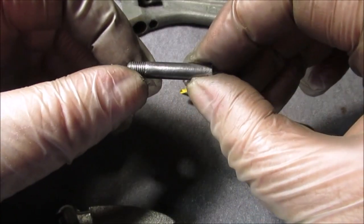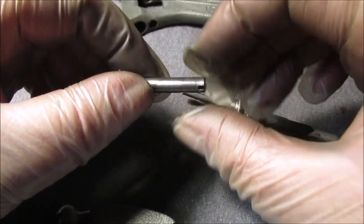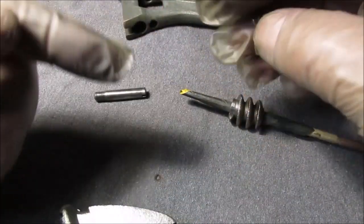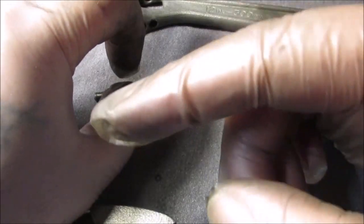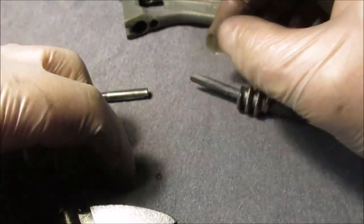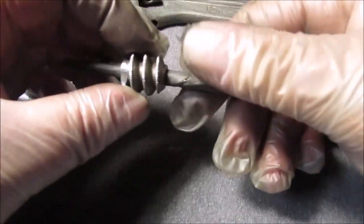We held this with rubber vice grips without damaging the threads. We have a two-inch wire brush in the drill. Here's the wire brush spinning right here — we're over here on the side, so the round part of the brush bristles are working here. We're out at the side so bristles don't fly at us, plus goggles, safety masks, etc.